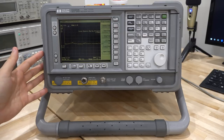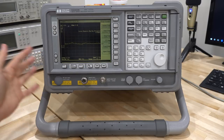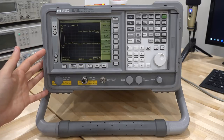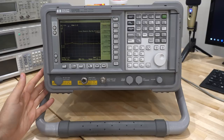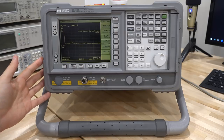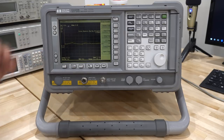The LCD is quite dim because these are fluorescent lamp backlit displays — they age and get darker. We'll see how easy it is to put an LED backlight on it. Since we have some knowledge from the previous repair, we should be able to take it apart, bring up the schematic and block diagram again, and find out at what point in the chain the LO has a problem.